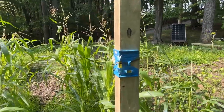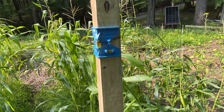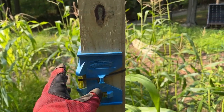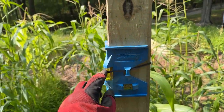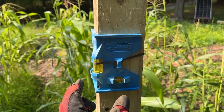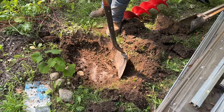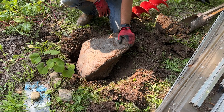What's the difference between plumb and level? Fence posts and walls — vertical things — need to be plumb. Things that are horizontal, like a four-by-four running horizontally, need to be level. So when measuring vertical elements you're checking plumbness, and when measuring horizontal elements you're checking levelness.